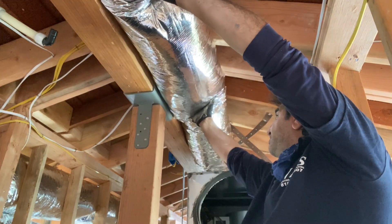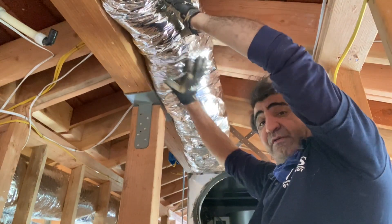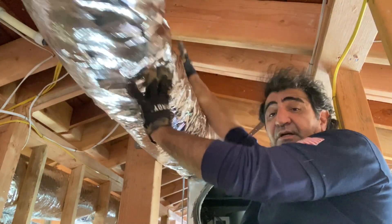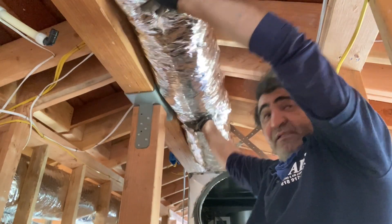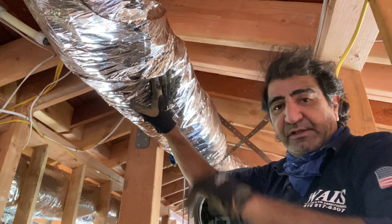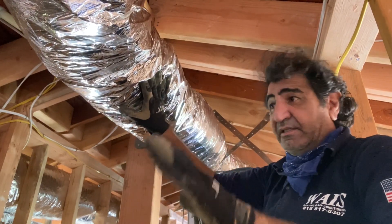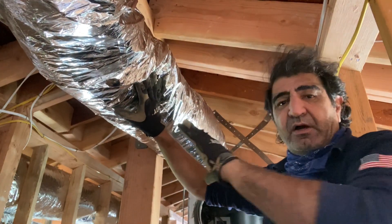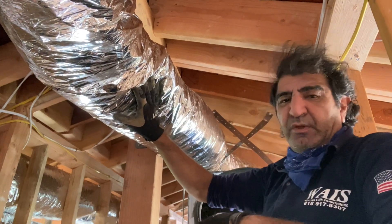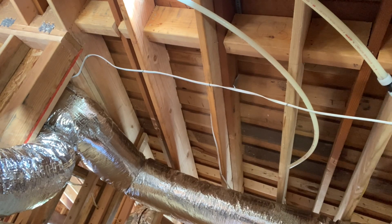This was not actually installed here. I will go from this corner of this beam right here, so the unit is here and I have plenty of space. I hate to see people installing ductwork right above the unit — that's not good. But please remember, this is a very different job we're doing here. The only space they left is just above the hallway — it's a 5 feet by 25 feet space for all of this work. Once I run my ductwork, there won't be any room to even walk if I run it from here.